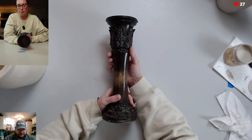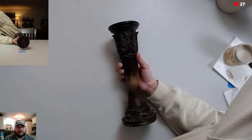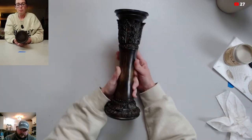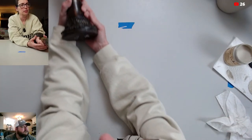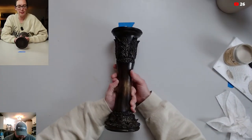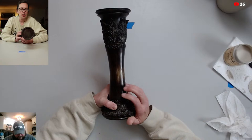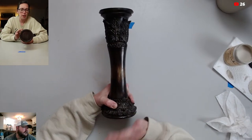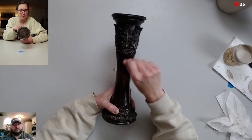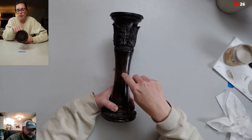I have these candlesticks — I wasn't going to do this tonight, but I'll go ahead and show you. These are resin, which is like a type of plastic — harder than regular plastic. Chalk paint is going to do the same thing to these: it would be a little bit more durable to paint these without priming them versus glass, but it's still a very slick surface and there's nothing for your paint to grip on. So these are definitely ones you need to prime.